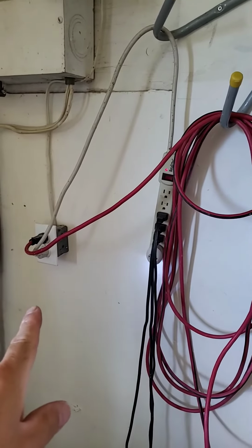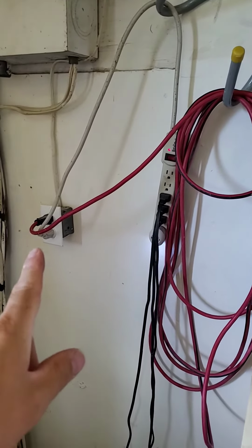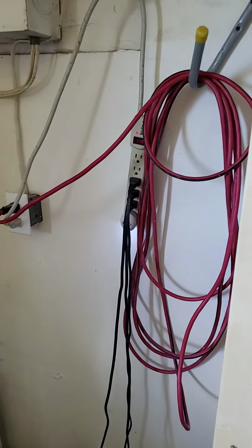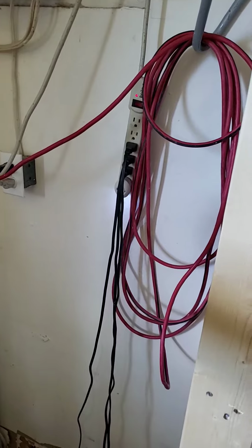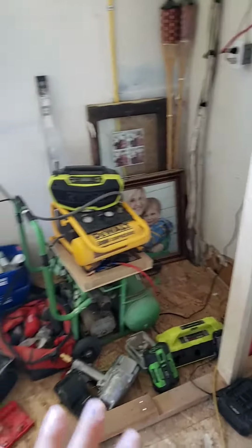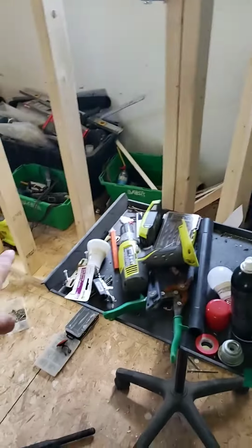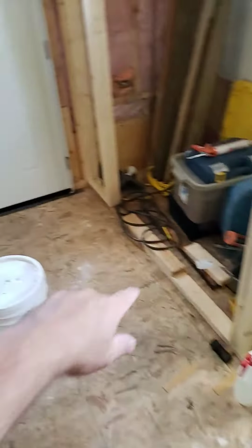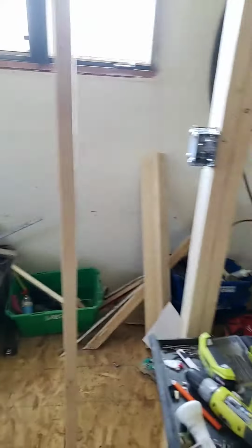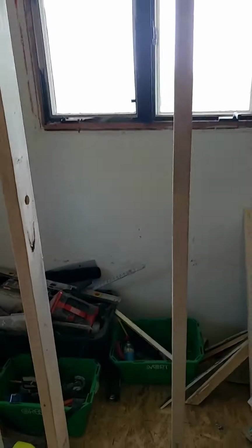And that will then be our constant because that plug is on a single circuit. There's nothing else going to it, so I figured we'd pull our constant from that. And we could even run plugs for our west side wall. Essentially, we could put a plug back there. We could put a plug centered down here, maybe just one plug on this center wall where the switches will go.